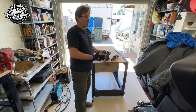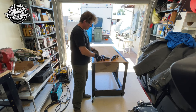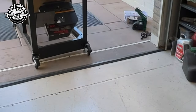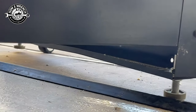For the Roto Bench, I don't think I'll need to lock the casters, but if I do, no big deal — pull them out, go to the drill press, pop a hole through, and I've got a lock pin. I've never seen anybody else do this; I think it's a great safety feature. I learned that the rubber lip by the garage door really wanted the casters to hop over it, so I needed to pin them in this case. I also realized the stock feet were causing it to jump when hitting that lip, so I'm raising those up a little bit more until I can level them.